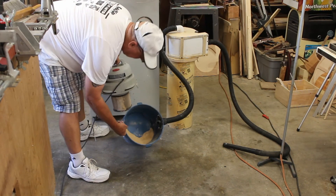A little bit made it in. All in all, that's not bad. I measured the amount of sawdust in the Thien baffle reservoir — it held 175 cubic inches. The amount that made it through to the vacuum cleaner was one soda-can full, about five cubic inches — that's around two percent, and I can live with that. It's actually not too bad for something made entirely of scrap. The only new materials were the silicone, the construction adhesive, and the PVC elbow on top — so about three dollars total, and that's quite a bit better than the cyclone separators you see for sale. Please like, comment, share, and subscribe.